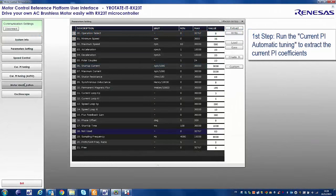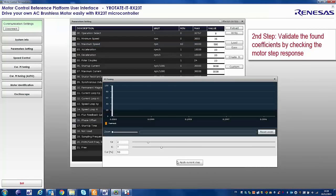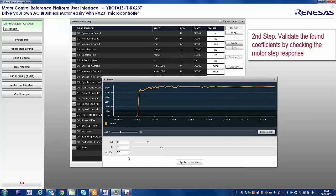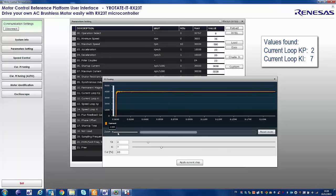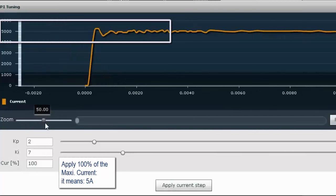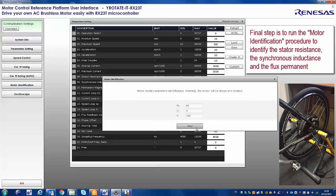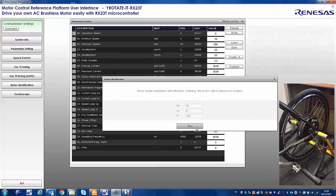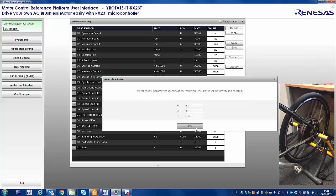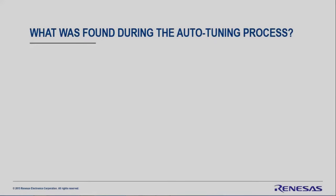Back in the PC GUI, running the automatic current PI tuning gives KP = 2 and KI = 7, which are very low values. We then test these by applying a current step to the motor and checking the response. We can also increase the step level using a percentage of maximum current — since max current is 5 ampere, at 100% we apply 5 ampere to verify the motor responds correctly. Finally, run the motor identification process to extract the three key parameters; do not apply any load on the rotor during this phase.